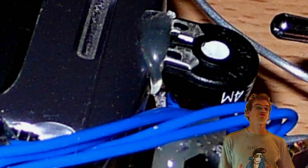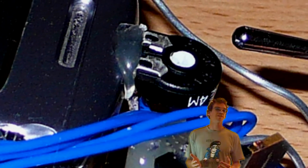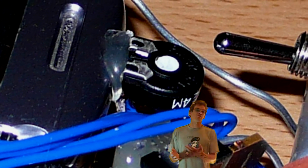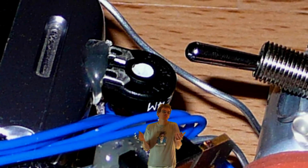Good! The potentiometer allows us to control how strong the signal is that goes through the transistor, and therefore how much power we send through to the motor. This is quite a balancing act, because if we make it too strong, then the phone gets starved for power and shuts off. If we make it too weak, then the Carphone just doesn't go anywhere.